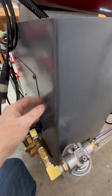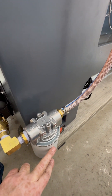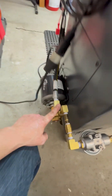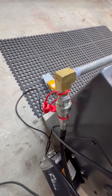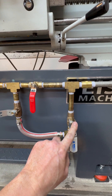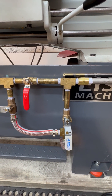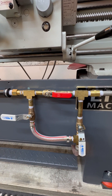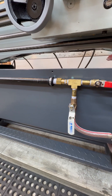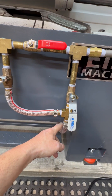Here's what we've got going on: using a sump on a lathe, using Astro Swiss HD and some Type F fluid. Intake comes through into the filter, from the filter into the pump, from the pump to a hydraulic hose quick disconnect — my feed line. This goes to the barrel; this controls my overall pressure to the barrel. I only run on an 80 PSI pump — might increase that later, might not, we'll see. Open up the valve to the barrel; this is a drain to either blow out or just let it drain overnight. My drain comes down and goes into the backside of the sump.